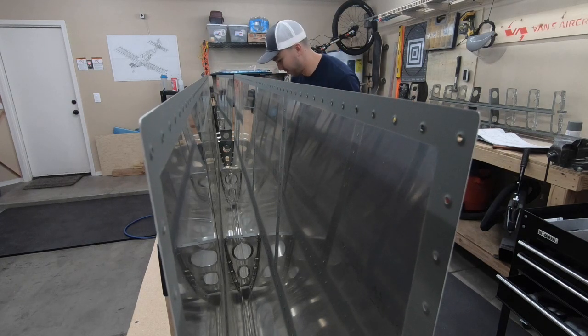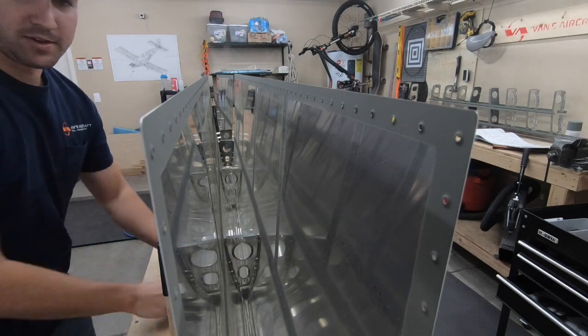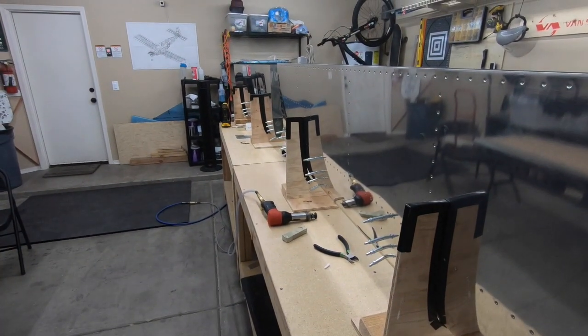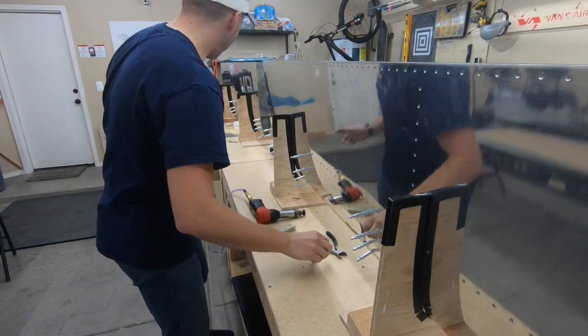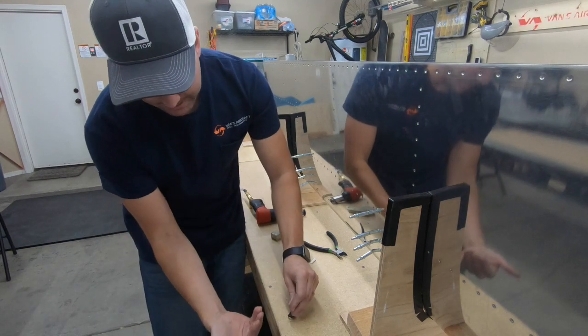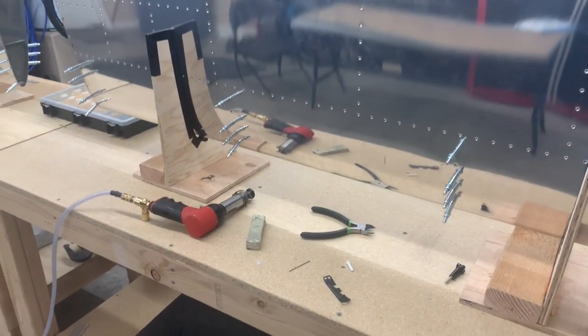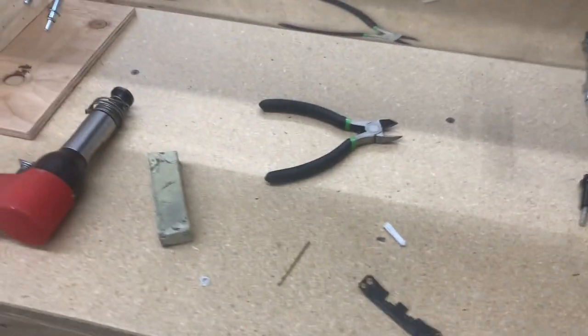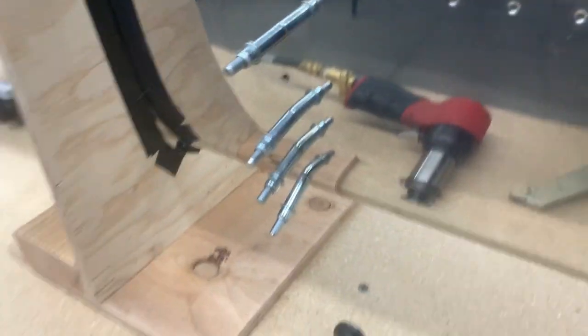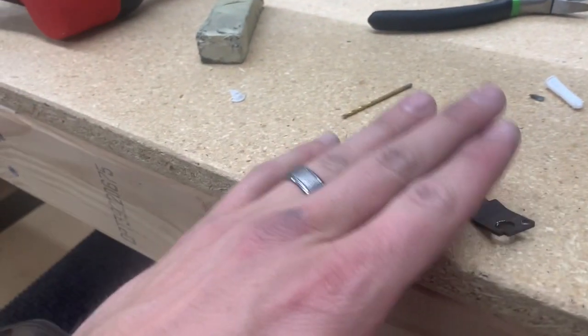That was really cool. Before the camera died I want to show what I was able to do, which may help other people out. The issue I was running into is near the front portion of the skin — the front portion pushes away really hard. The material is pushing away from the surface, so as soon as I started bucking on the back side, the material had no reason to hold itself flat against the surface. The camera battery died right as I was getting to the main point, so I'm on my cell phone now. The arc of the leading edge here was sitting further away than the inside structure, so when going to rivet, the material was pushed away from the surface.